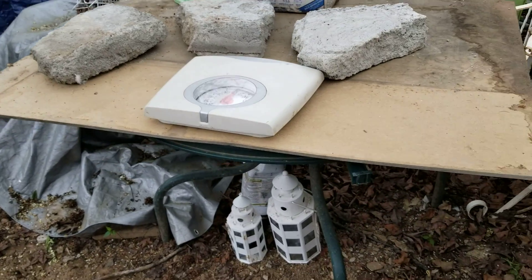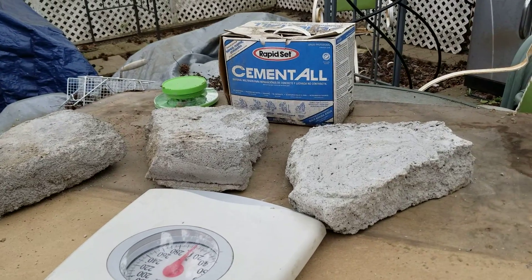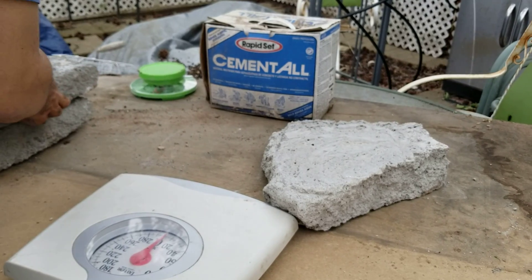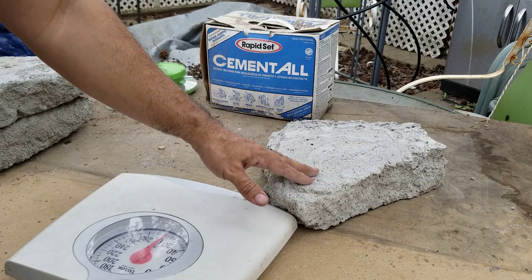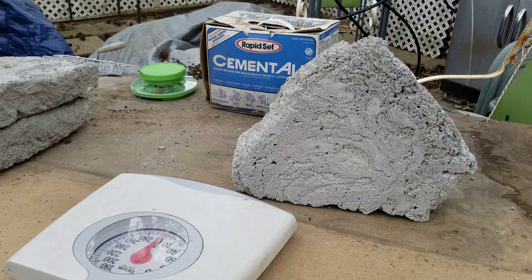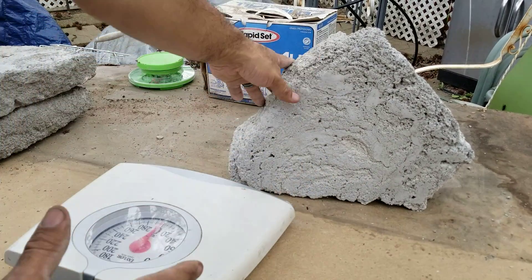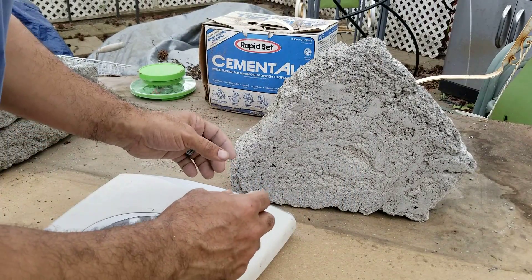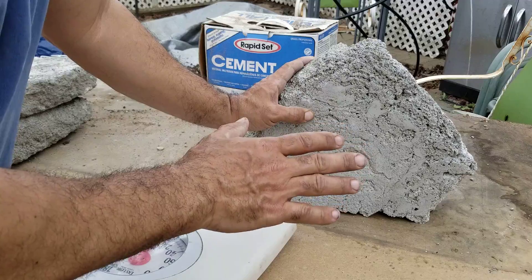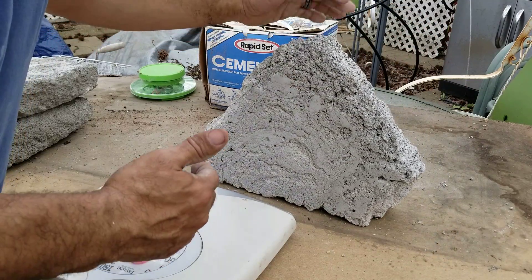The reason — and the cement you see in the background — was all part of my idea for the interior walls of my home. I'm planning on building a dome home and the interior walls are going to be made of air crete. I'll be using air crete for two reasons in my build project. The first will be as an insulative layer on top of my structural layer of cement. I'll have a dome reinforced with rebar, and about two to three inches of cement, with about 12 inches of air crete on top of that.